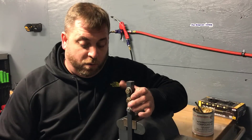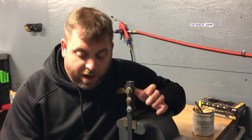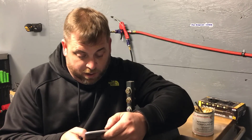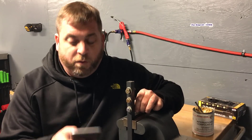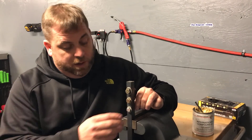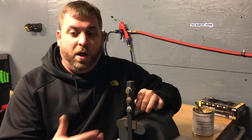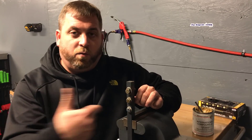Let's get into understanding about the bolts first that we're going to torque. I have a couple different bolts here — just for demonstration purposes. I have a grade 5 fastener and a grade 8 fastener, both fine thread. On a 3/8-16 or 3/8-24 bolt, the grade 5 maximum torque is about 35 foot-pounds, and the maximum for a grade 8 is 50 foot-pounds. Each bolt diameter will have a maximum amount of torque.